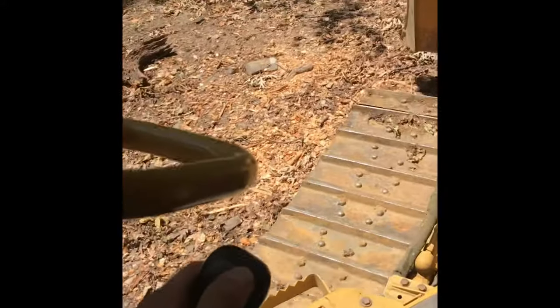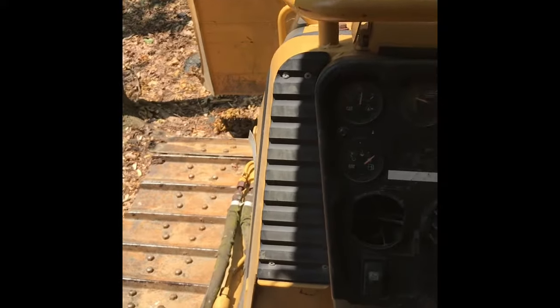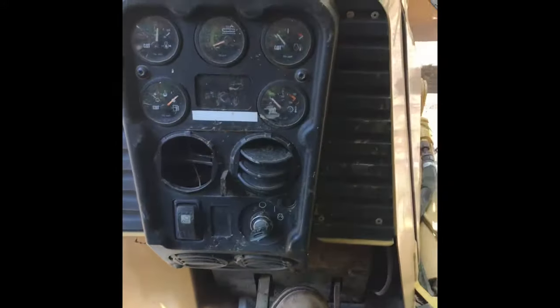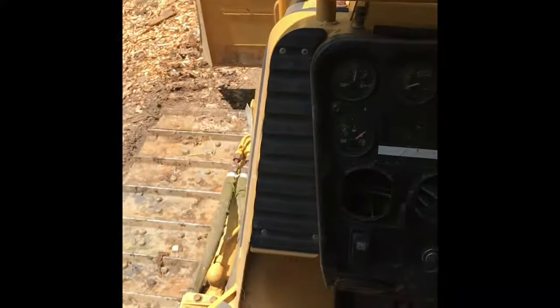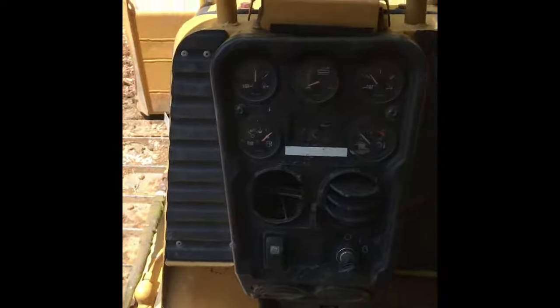You can hit this button and you can see it gets a little faster. You can hit that speed down — it's a fine grader, and the brakes stop the machine without taking the RPM down. This always gets me a little confused compared to my skid steer — whatever way you push it, back to the shoulder, it goes the opposite of my skid steer. Sometimes I get thrown off when those controls come running this way. Get that throttle down, drop the blade, and we're out.